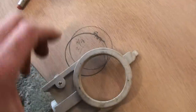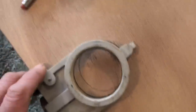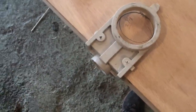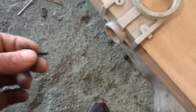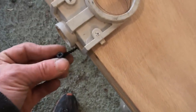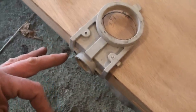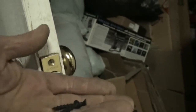I'm going to line this jig up over that circle perfectly, which is going to give us the correct height for the lock and match the hole in the old frame. I'll put two screws right here and here to hold the jig while I work, and when I take those screws out that's also going to be the screw holes for the new lock striker. You see those two screws on the striker — the jig makes those holes.